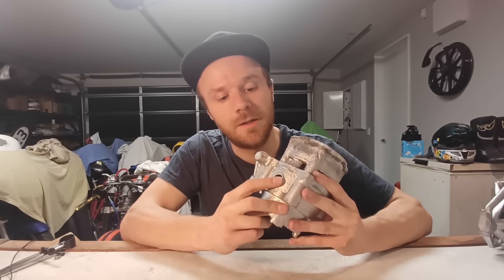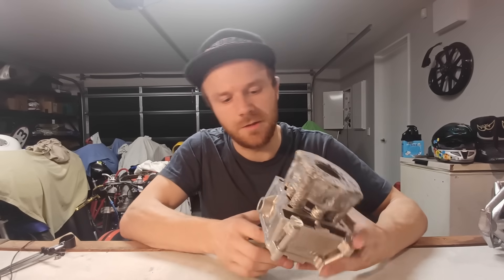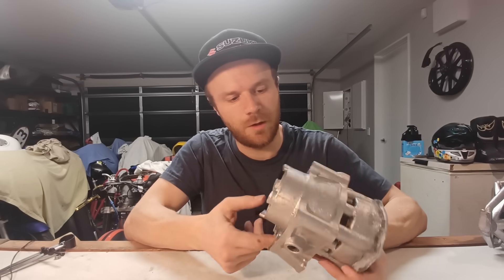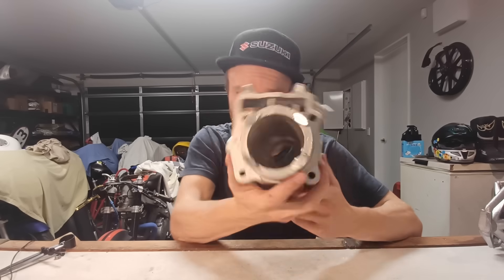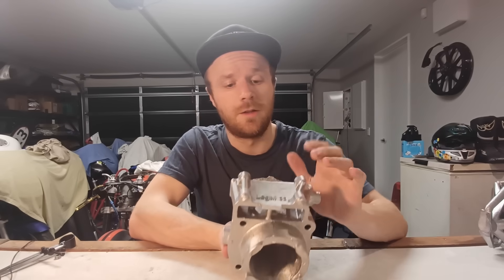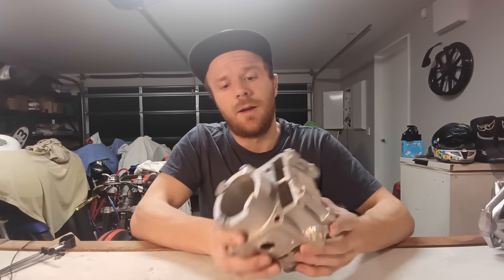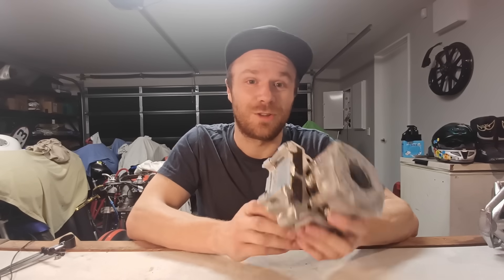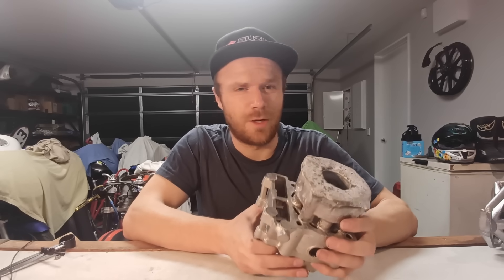All I've got to do is make a wee plug for the water jacket hole and weld that up, then it'll go out up to the cylinder head. That was just to help support the core, which it did its job. Then there's a whole bunch of machining - I've obviously got to cut the main riser off. This barrel is pretty good - we have a bunch of supports in the cam chain gallery, which is one thing I forgot on the last two attempts. So luckily this one can actually be properly heat treated and we shouldn't have any distortion in the cam chain gallery. I'm over the moon - it only took three attempts, which is a lot quicker than it took for the cylinder head.